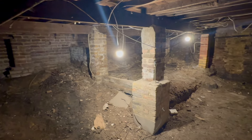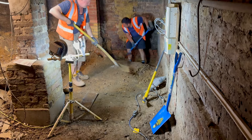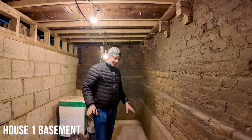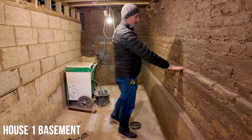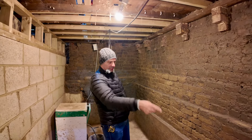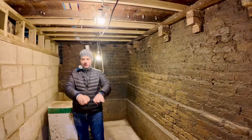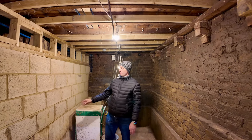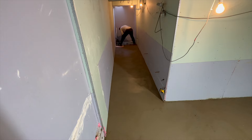The level here was somewhere up there — we need to dig another 600mm. This is the head height, so I dig around 500mm. I need to do underpinning between the houses to support the house. You can see all the sections here have been done in sections. I've done massive reinforced concrete with mesh, and now we're ready to put the insulation, delta membrane, and plasterboard.